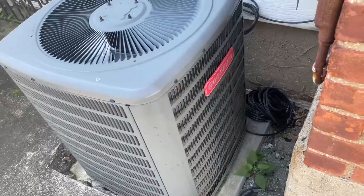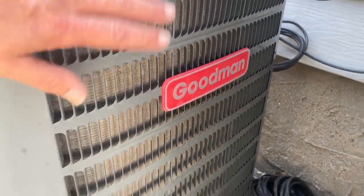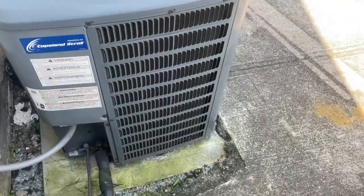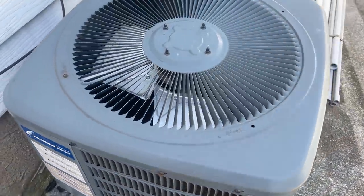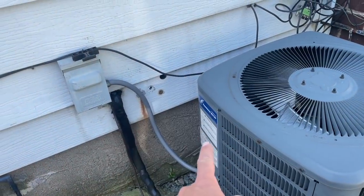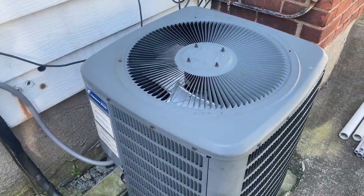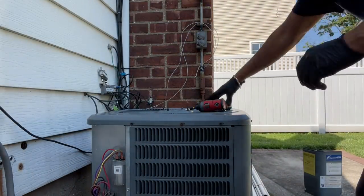If you ain't testing you're guessing — it's me Mikey Pipes, did you miss me? I'm out here with a Goodman — Easy Heating and AC, 'Relax, it's a Goodman.' We're going to do some annual maintenance on this. I'm going to flush it out with the Blue Bright. The coil is giving me high head pressures and she's dirty. We're going to acid wash the coil, test the dual capacitor dynamically with the system running, and get her running like brand new. Stay tuned, thumbs up the video — let's start taking this bad boy apart.